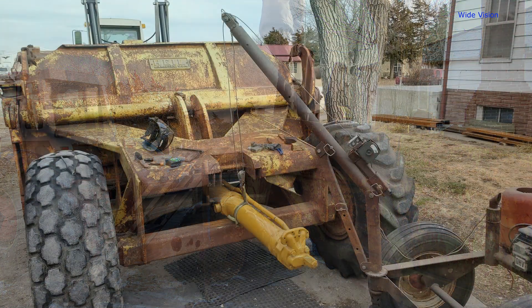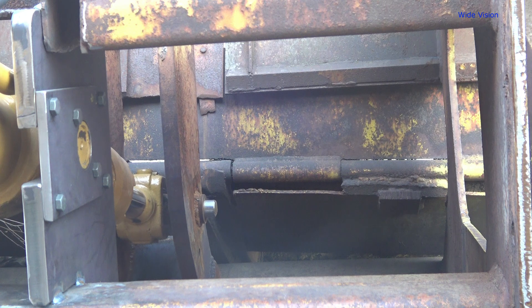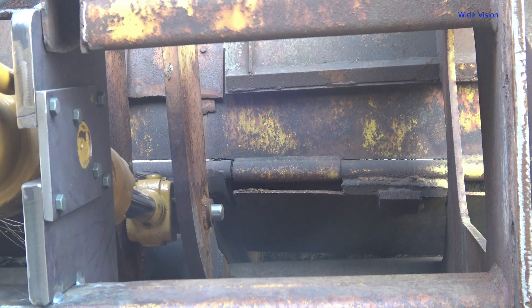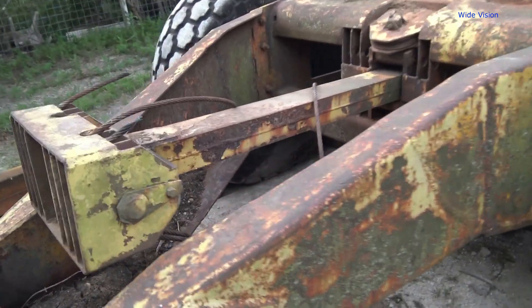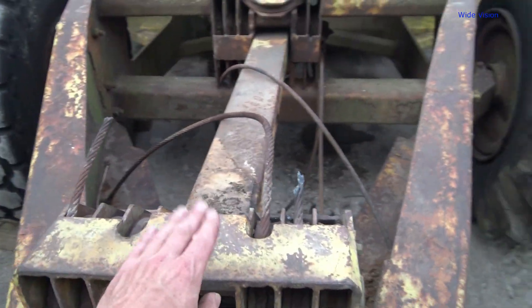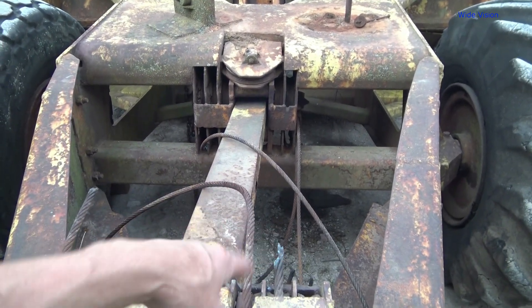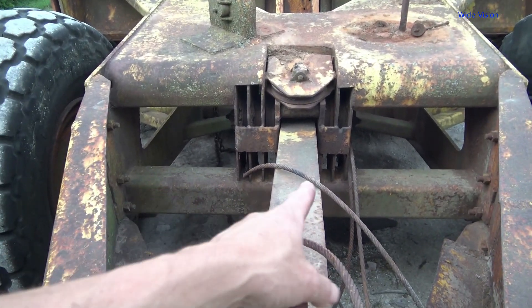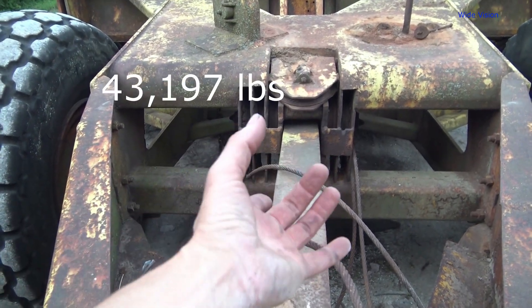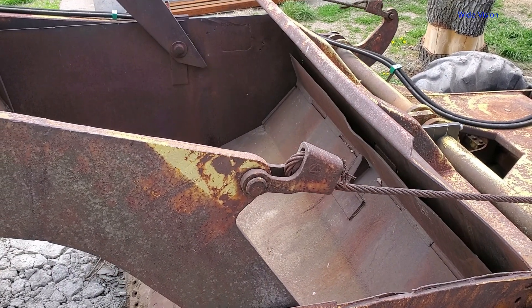The rear cylinder, which operates the apron and the dump — well, that was pretty much a swag. With that interesting roller mechanism, I really didn't know how to figure the required force. I knew I wanted a trunnion mount, and there weren't many choices for that. I also guessed by measuring that it needed around a 42 inch stroke. Looking at the surplus center once again, they had a 43.5 inch stroke trunnion cylinder with a 5 inch bore. I basically hoped that that 5 inch bore, producing 43,197 pounds of force, was enough to eject the dirt. So far, the customer says it's working great.